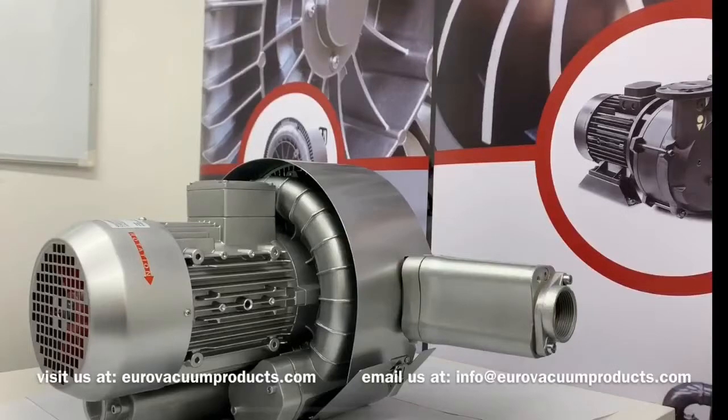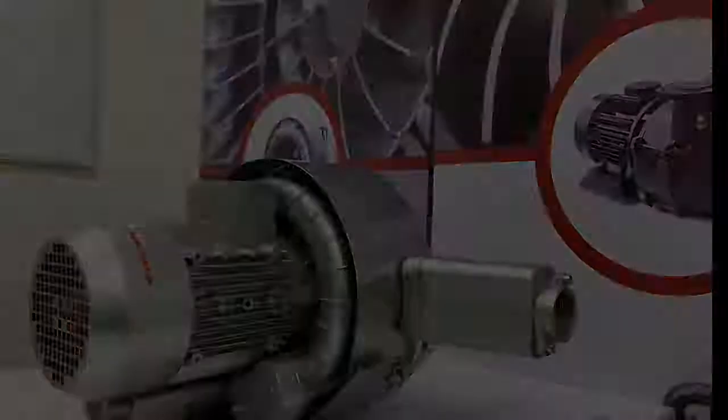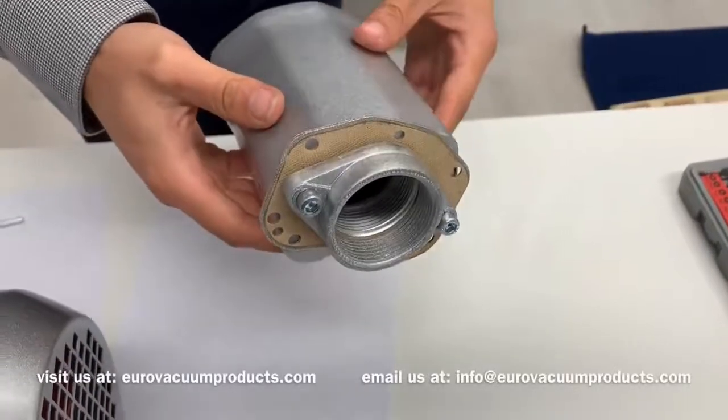To begin, check the operating pressure through the pressure or vacuum gauge, check the calibration of the safety valve, measure the power absorption to compare with that on the nameplate, and set the thermal mode to protection — we'll show you how to do that at the end.